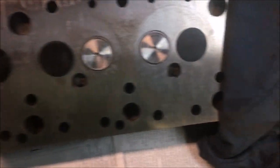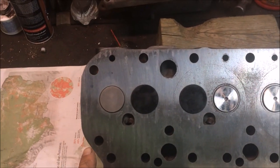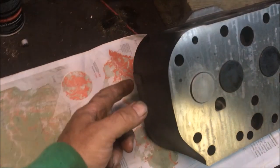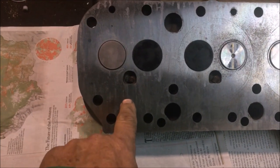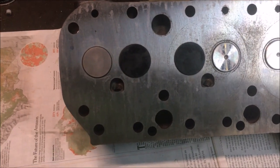I'm pretty happy with how the valves turned out. One thing I don't know if I mentioned — the cylinder heads for a D17 and a WD-45 are actually about three-quarters of an inch taller than the older heads. They use that space; I think the primary reason for doing that was to move the spark plug in closer to the center of the cylinder for more efficient combustion. We'll put this to bed for now — I don't have the springs, keepers, and retainers washed yet.